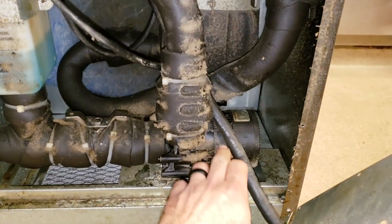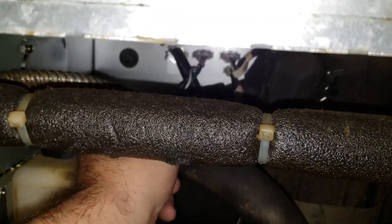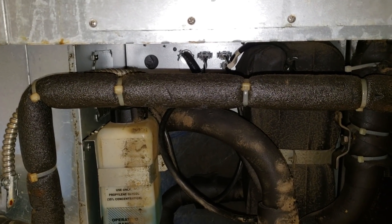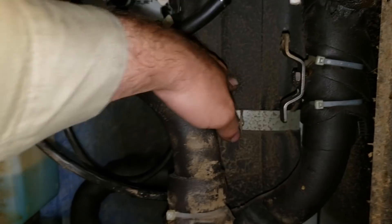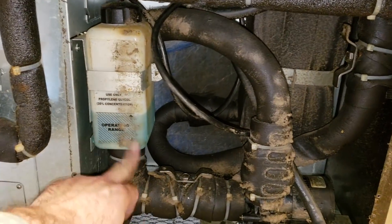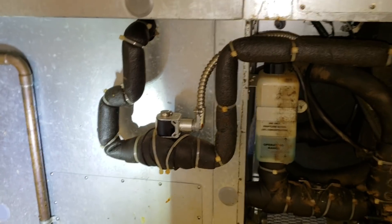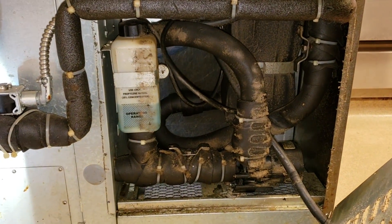Here's our glycol pump - little guy right here. It's got a plug going into the top. I was able to get an amp reading on those wires. It has a plug that you can disconnect - I disconnected it, checked for 120 volts, had it, then amped it out and had 0.9 amps. My flat plate heat exchanger is back behind here inside. It just pumps glycol, and it's got a solenoid to shut off the bottom section glycol flow so it can continue to cool the top, because the top runs a little colder than the bottom.